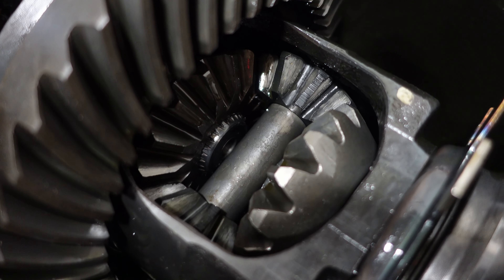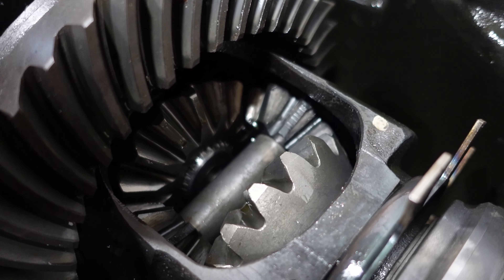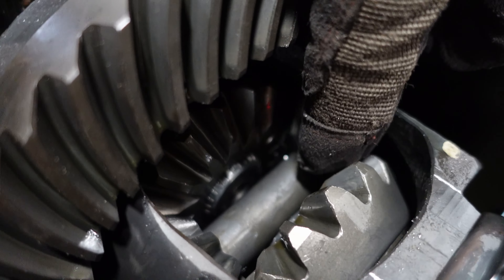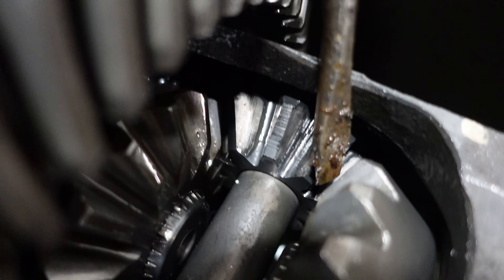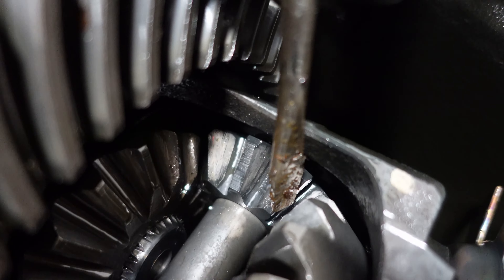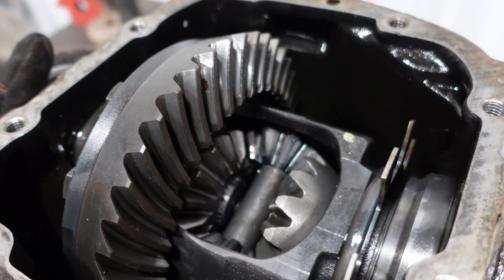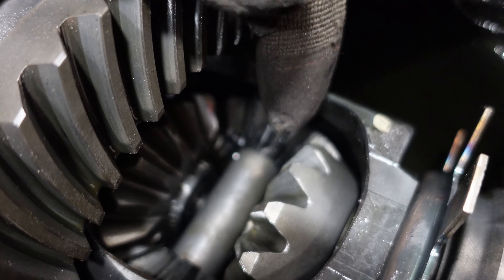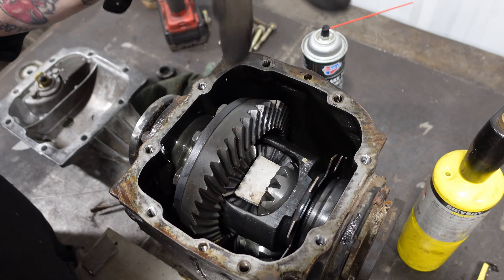One of the things you want to make sure of before you start welding is that you want these gears to be as parallel as possible, because fit-up is the most important thing. If you've got a giant gap on one side and no gap on the other, you're going to have a hard time welding both sides. So what you want to do is rotate the gears until you get to a position where the two teeth are pointed straight up, giving you even gear contact so you can weld everything together.